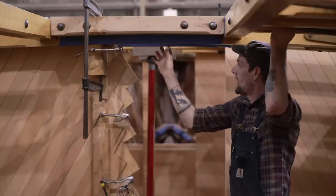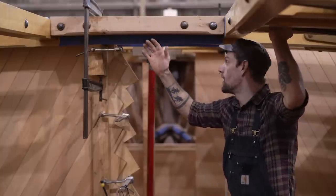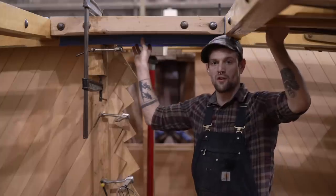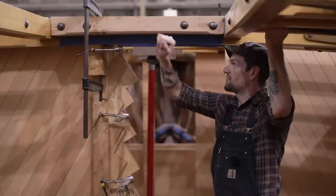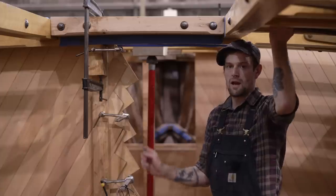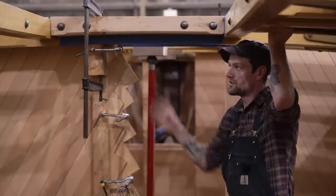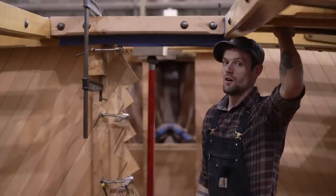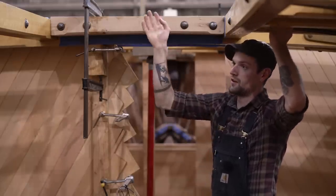This block widens the area just aft of the mast, between the forward face of the skylight and the aft end of the mast. And so it gives you a little bit of working space there on deck. If our skylight starts here and goes aft, if that skylight was tight against the mast, you end up with this thin little dead zone between the back face of the mast and the forward face of the hatch. So you can put a deck box there, or whatever, a little bit of working room, coil up your halyards and stuff like that. So anyway, the deck comes onto this beam, and then the hatch goes here.